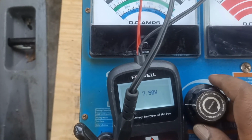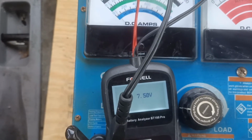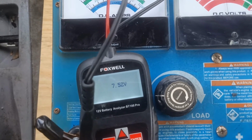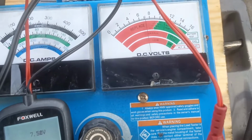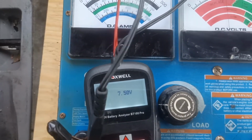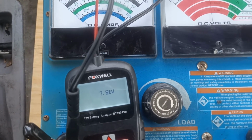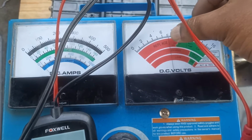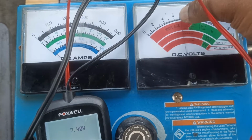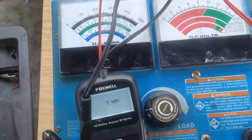This should be good for us to be able to know how well they will behave individually. If we can do this and it's beginning to drop the voltage like that, okay, so I believe I'm ready now. So the next thing is to dismantle all of them and then test them individually and time them to know the time it's going to take for it to drop from 7.2 to something like 6 or 6.5. Just have to form a baseline for all of them. All right.